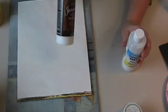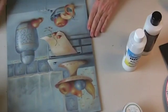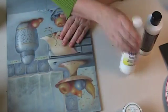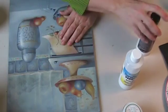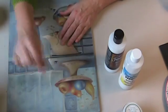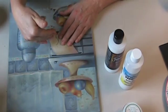I have to say though, the Traditions varnish is pretty neat, because I don't know if you've ever finished a piece, but you're getting ready to base coat, and you're brushing it on, and you get these little drag things. In normal varnish, nothing will help you do that. You just have to move quicker, and you have to not let it dry so much. With Traditions varnish, you can pre-wet your surface, or you can dip your brush into some water, and reawaken that varnish so it prevents those things from happening.